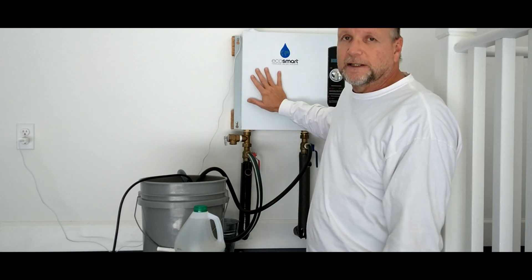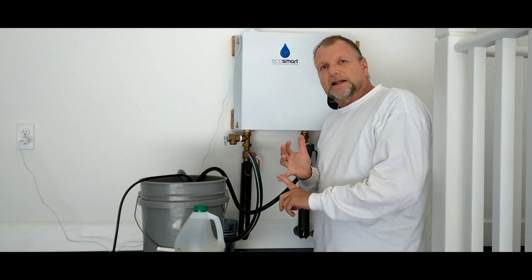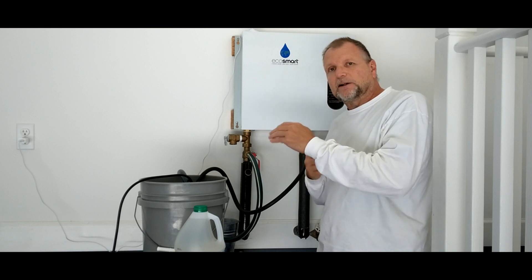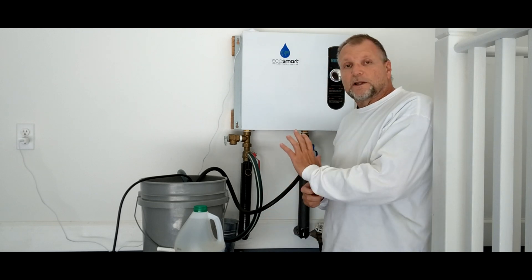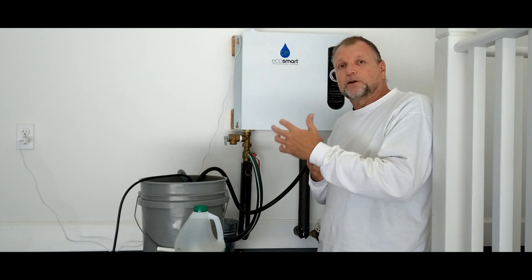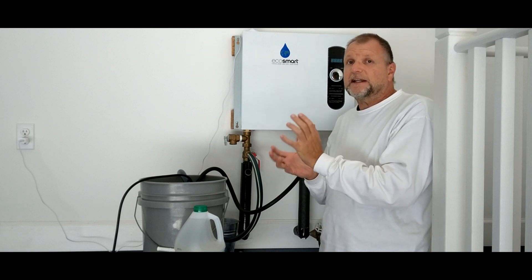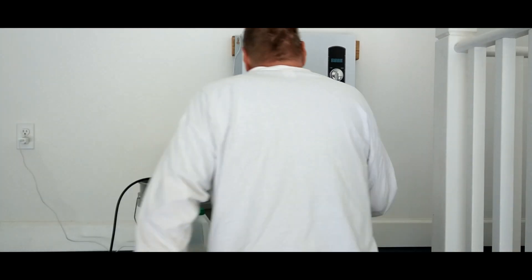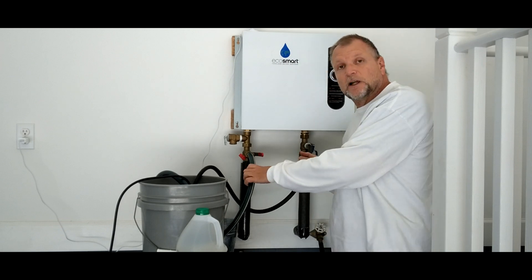Full disclaimer: I have a whole-house water filter with a carbon block and a pleated filter upstream, and I change those filters out monthly. I'm hoping that's been breaking down the minerals before they reach the tankless unit. The goal is to keep calcium out of these coils — calcium will stick right to the coils and start to degrade internal parts like the sensors and heating elements. You can replace the heating elements, but they're about 80 dollars each, and the whole unit was around $600–$650, so it can get pricey.